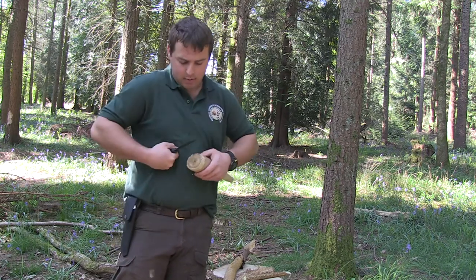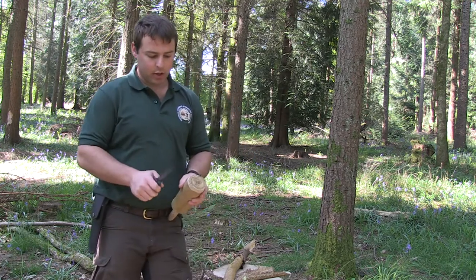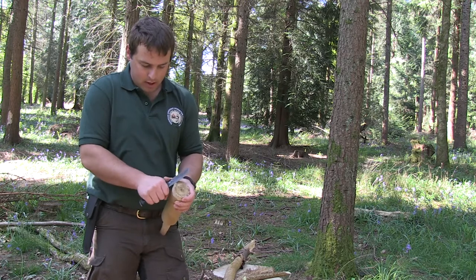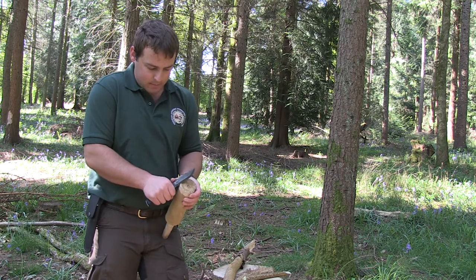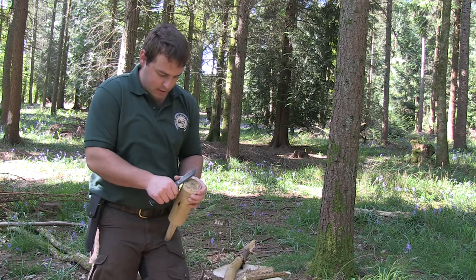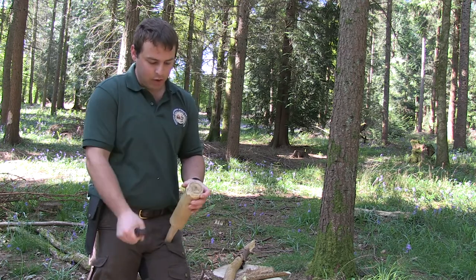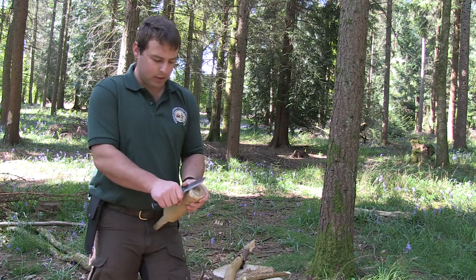It's still safe because you're still cutting away from yourself. I'm just going to do a quick trim around the very top edge using thumb-assisted leverage. This is just intersecting the grain of the wood, so when you're hitting down on it, the shock waves are getting dispersed out across the entire piece of wood rather than down through the grain, so it's less likely to split on you.